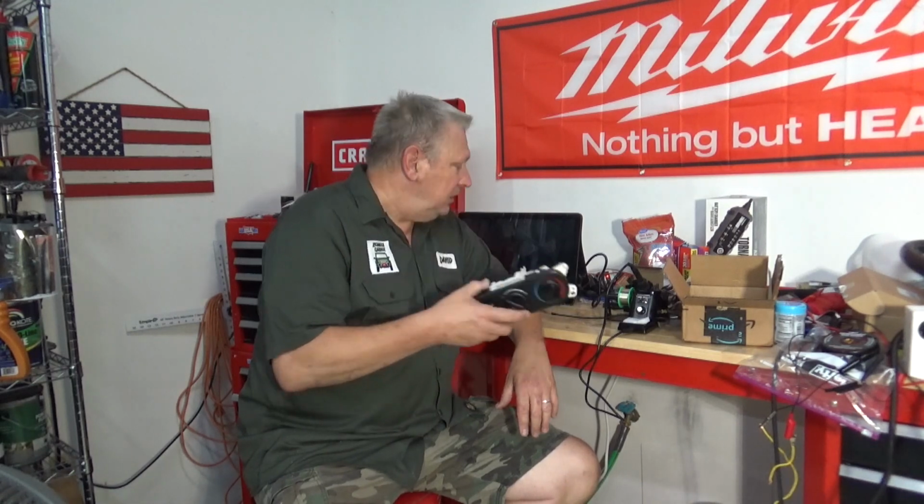The aggravation of this is that at night you can't see it. The lights are burned out. So usually on older things, you can just pull the bulb out of the back, put a bulb in it, and you're good to go. Well, the brilliant brains at Chrysler decided to solder the bulbs to the board so they're not replaceable, and you have to replace the whole thing for, like I said, 400 bucks. So I'm gonna get around that.